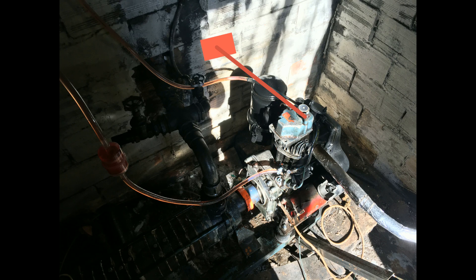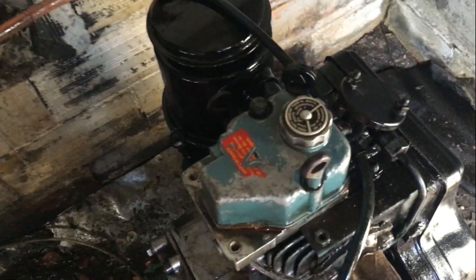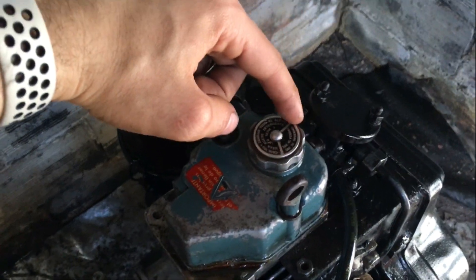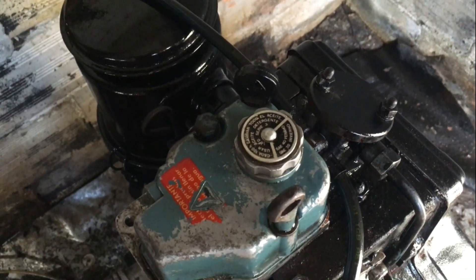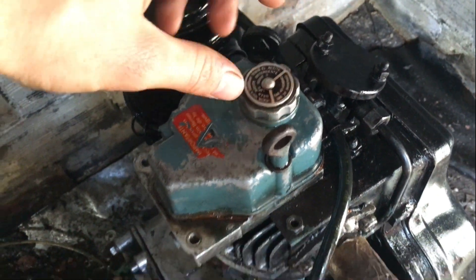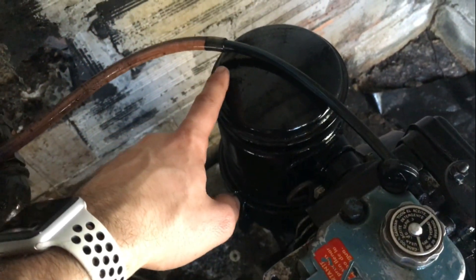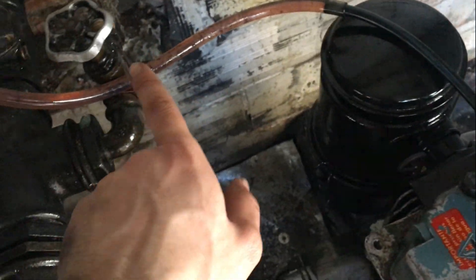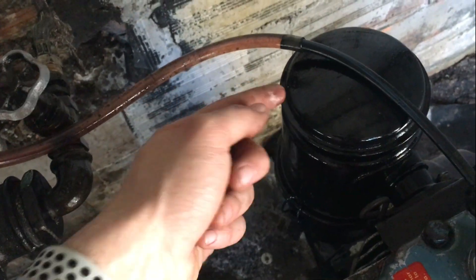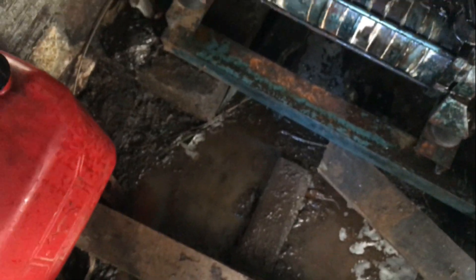I would also like to install a torque damper using a shock absorber, but I need to sleep on it. Another problem I'm facing is that everything is full of oil, and this problem comes from the oil cap. As you can see, it's not sealed — it is vented. At full throttle it's just spilling out a lot of oil and I don't know why. It shouldn't be spilling out oil. So the plan is I'm gonna change the oil, see if the viscosity was the problem, and if this doesn't fix it I will check the oil pressure and work from there.